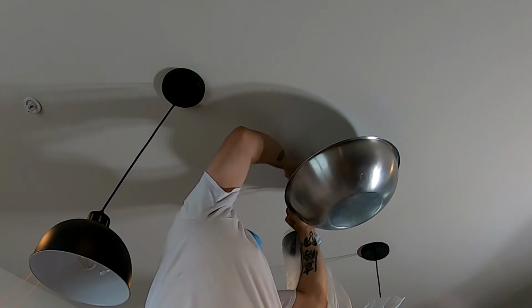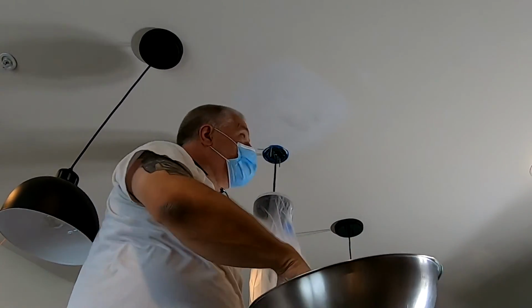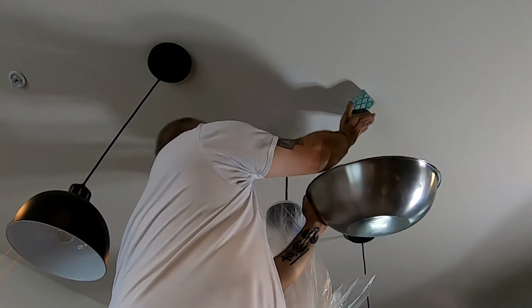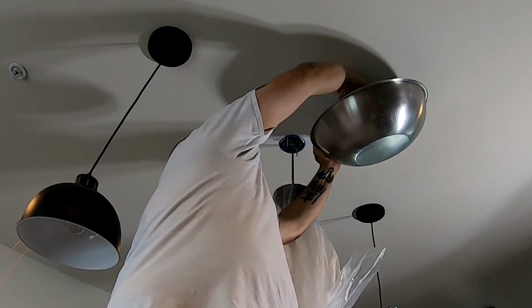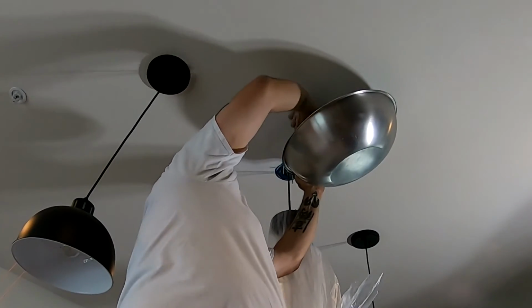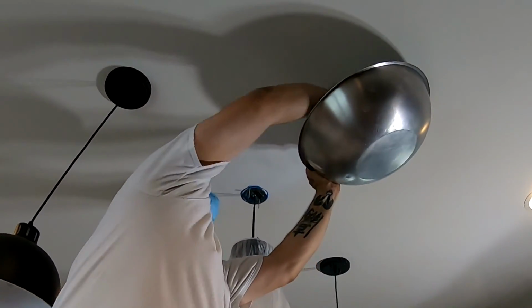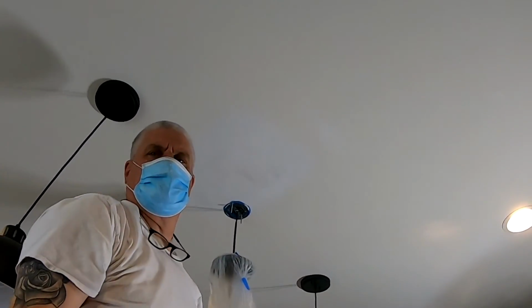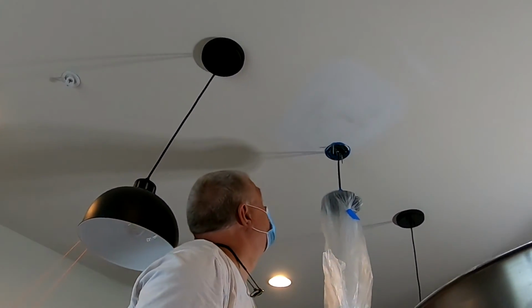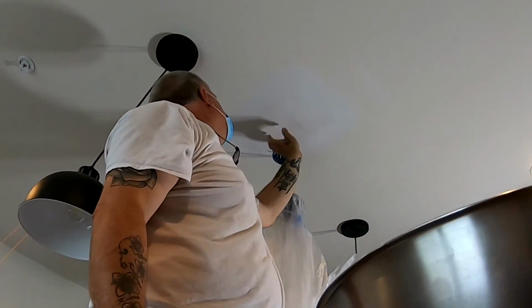A really great way to keep the dust down is to use a bowl or something underneath where you're sanding. That's a little bit cumbersome, yes. I'm in a very expensive home here, and I could quarantine the whole room off with, you know, like a Dexter type of kill room where there's plastic on all four sides and the floor, but this right here catches like 90-something percent of it, and I don't need vacuums and everything running in order to collect it.